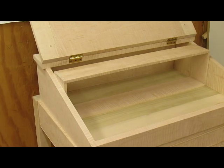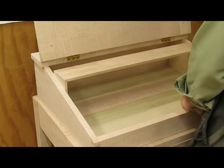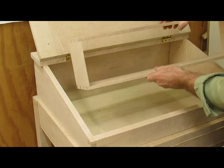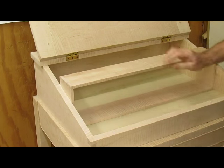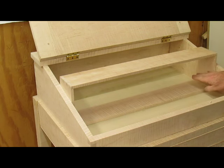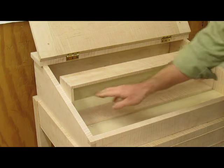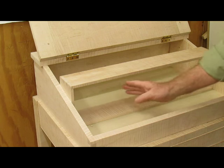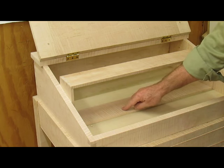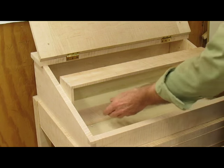So I made this box with the pieces that you saw earlier, and the thing is starting to fall off the front here. I don't want to fasten it down yet. But as you can see, I dovetailed just the short pieces in here. When this is completed, I'm going to put three drawers down here, which will be about half of the side, and then four pigeonholes up here. So I need verticals, a centerpiece, and verticals for the pigeonholes. All that will have to be cut to fit, and then I'll put some grooves or dados into the pieces where you want the pieces to slide in. So this will come apart, and those will be the next steps.